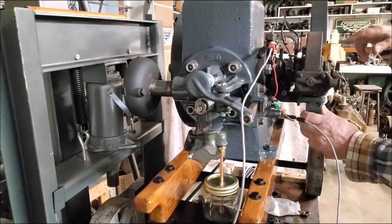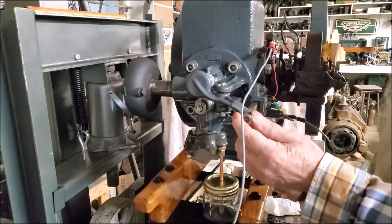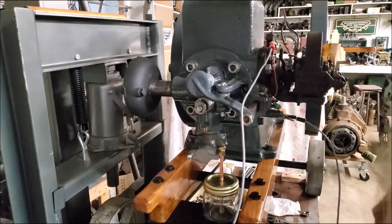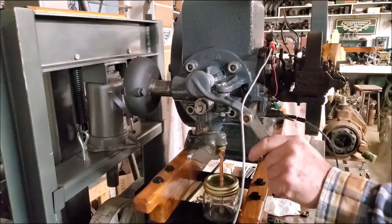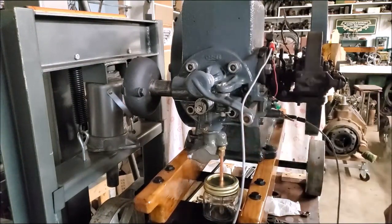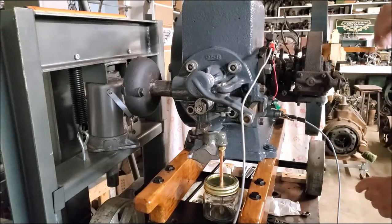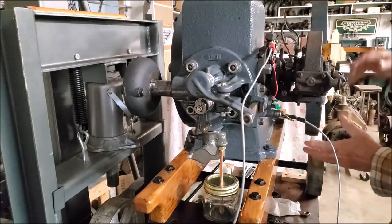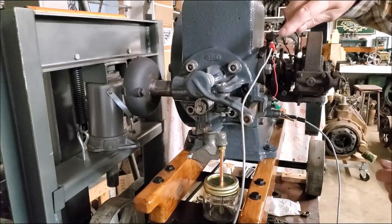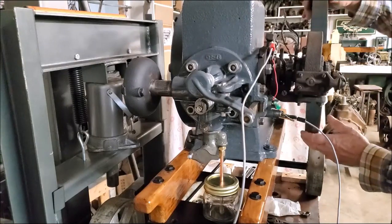When all that right there is lined up, you come up here and on your adjustment on this push rod you're supposed to have about a sixteenth of an inch - it's loose and in the correct position. When you turn this flywheel in rotation it's supposed to run towards the outer stroke; this valve is supposed to start closing, and when it reaches the bottom outer down here it'll be fully closed.